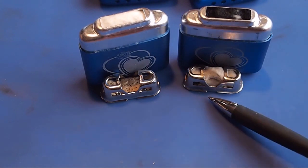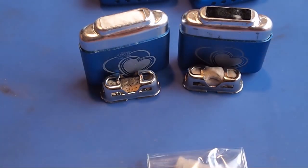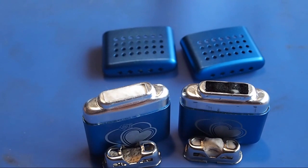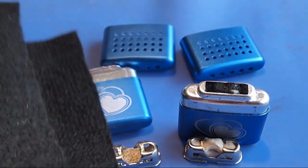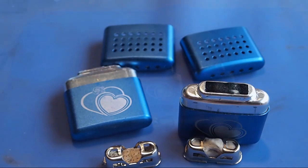What we have here is 1% proper pure platinum in a catalyst on a proper substrate, and I want to test whether that makes any difference in the heat output. The one on the left has the standard cotton batting fill, and the one on the right has the reservoir replaced with carbon felt material, which is what we use and will be putting in the rebuild kits. I'm going to fill these up, light them up, let them sit for a while, and take some temperature measurements.